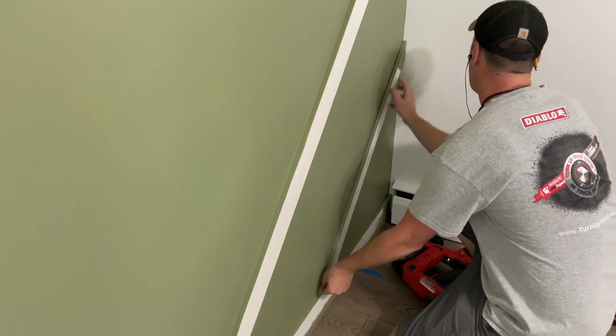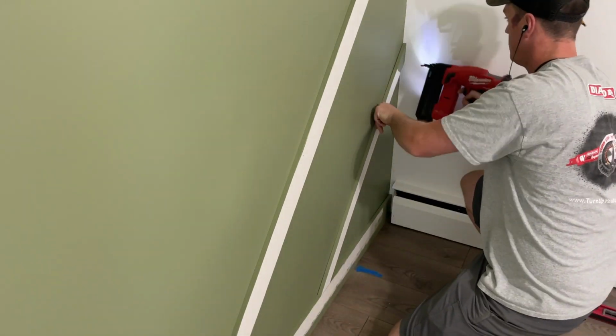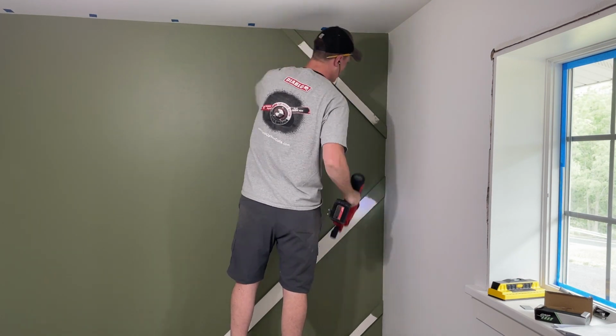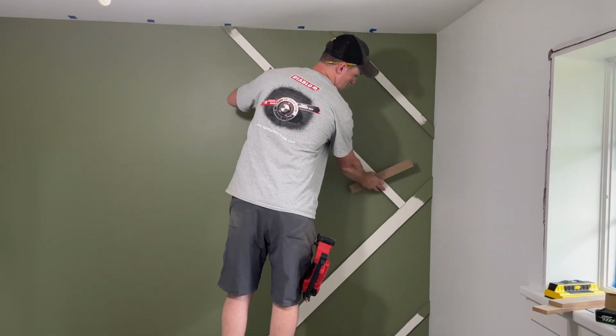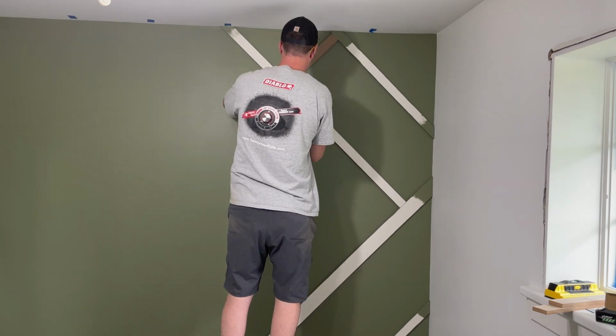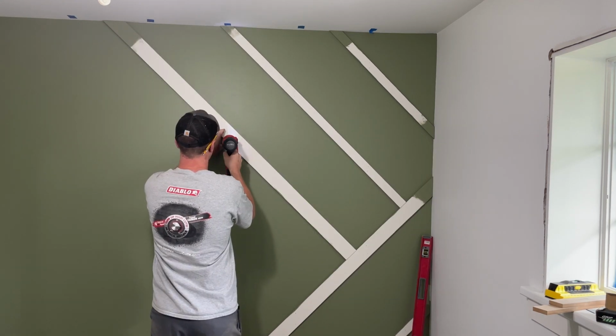You can see I also pre-painted all the ends that hit the outside wall or ceiling, so I wouldn't have to go through afterwards with a brush and tediously cut in again, and this ended up working awesome. Once those starting pieces were on, I cut some scraps of the MDF down to size to act as spacers,